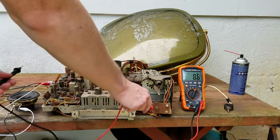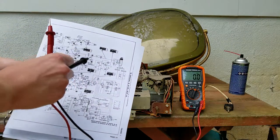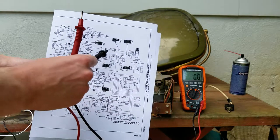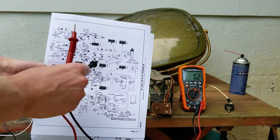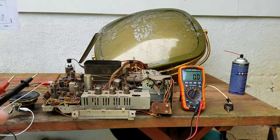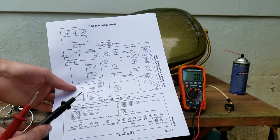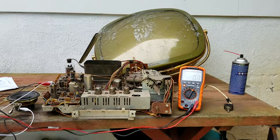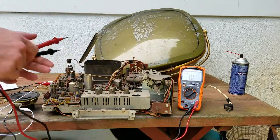I'm not sure if the brightness control is acting up or a capacitor is breaking down somewhere. According to the schematic, it should come right through that connector, through this 220K resistor, then to the brightness control - and that should be 35 volts. We measured over 100 volts there, so something in this path is messed up. My bet would be the brightness control. Let's turn this off and do a continuity check to make sure that connector has continuity to ground.